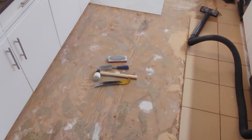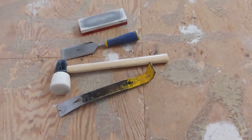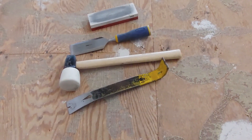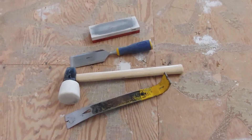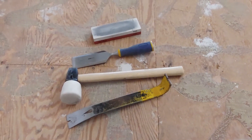I've got enough here to lay another piece of backer. Tools I use are pretty simple — just a flooring mallet and a super bar. I use that to do the heavy lifting of pulling up the tiles. You just wedge it under the back.